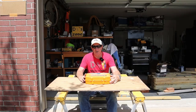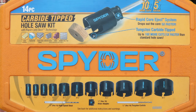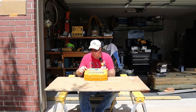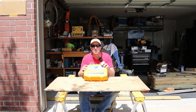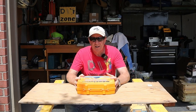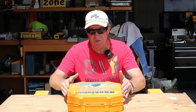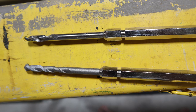Our next tool is definitely one you're going to want in your arsenal — a hole saw kit. This is a 14-piece carbide tip hole saw kit. It can do wood, plastic, cement board, concrete blocks, brick, and ceramic. I got this at Lowe's. It comes in a nice compact case and includes two different bits — you need to look at them closely before you use them.